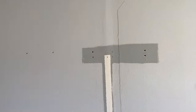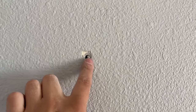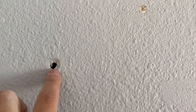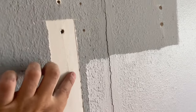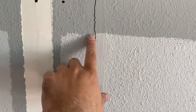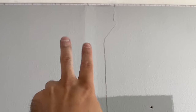Take a hammer and bang around all those things that were sticking out of the wall to make an indention — that way it's not sticking out, it's indented in. I just cut a line right here to get to the solid tape. All this tape was ripped off down below so I'll have to replace that and put a seam of tape right here as well. This was the actual foundation crack, so I'll go ahead and cover that while I'm doing this. I'll fan it out because this wall is not level — it's taller here and lower here — so I'll fan the mud out and then retexture.